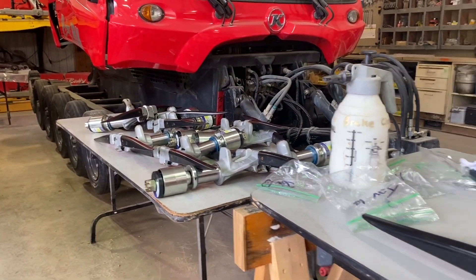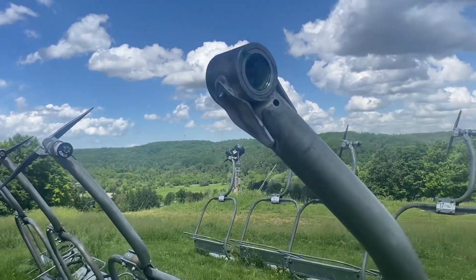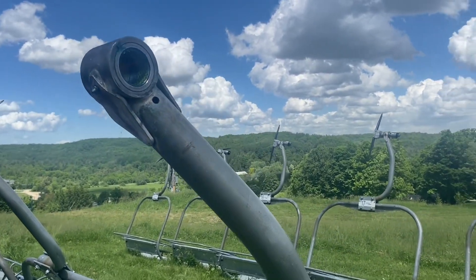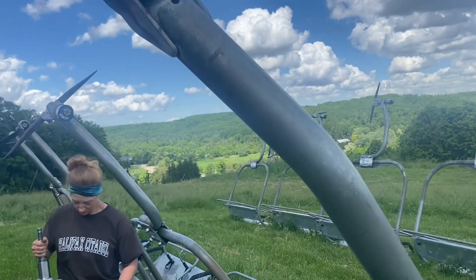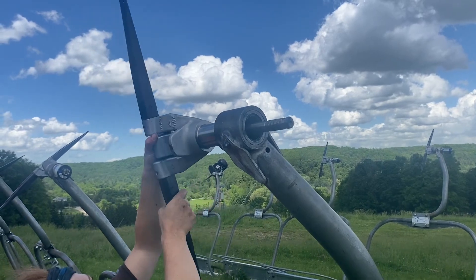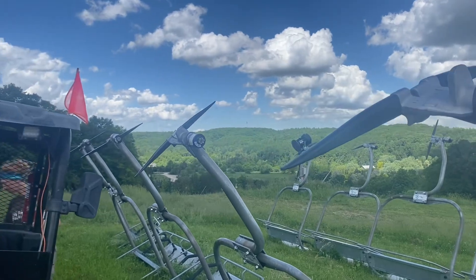We're giving everything another good thorough visual inspection while putting all this back together. We've got the pile done over here and we'll put the hanger arms back on the Javelin chair and start putting grips back in. Just finishing out the last chair, getting the grip in — pretty straightforward practice. We just throw in the barrel here, which is the top of the hanger arm, and give it a grease while giving it a complete full rotation. That gives it really nice distribution around the bushing. Then we'll put the sway dampener on, the spring pack, and it'll look just like that.